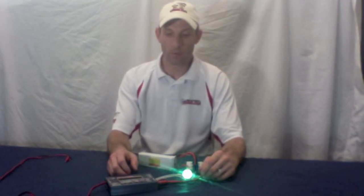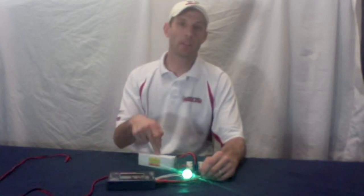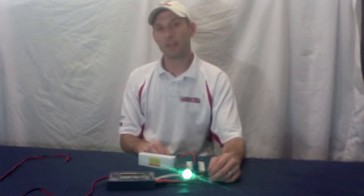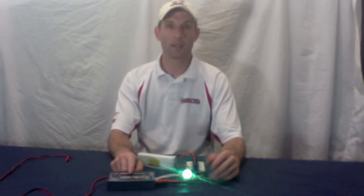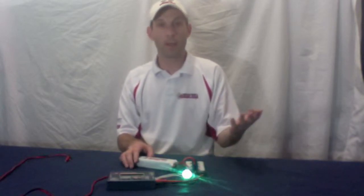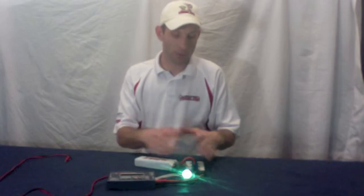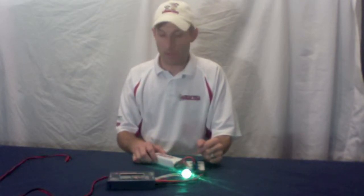It really can't even do that much. To figure out your max charge rate: if this is a 50-watt charger and you're charging 11.1-volt three-cell batteries, take 50 and divide it by 11 — that's roughly your maximum charge current in amps. For example, if you're charging at four amps and you have four batteries, each battery gets one amp. The charger just sees all the batteries as one big battery.